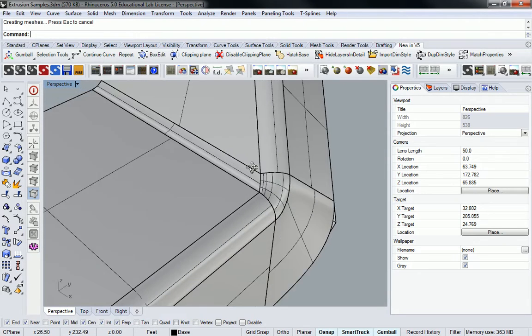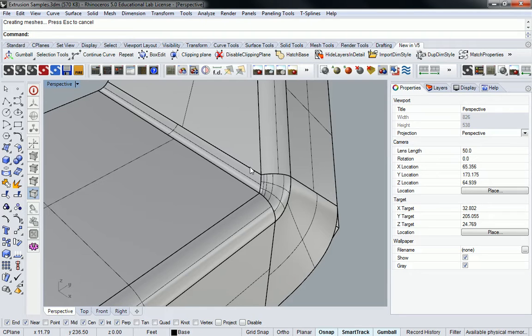And, you know, it's stuff like that where we tried loft, sweep one, sweep two, patch, blend surface, and finally wound up at network surface. That actually worked for us. And actually with this, we could probably use many of those after I finally got to a solution that could kind of work. But sometimes you just got to try a few out and think through methodically about how do I get the geometry that I need for this tool to work, right? In this case, it was four complete edges.